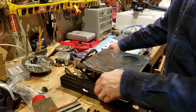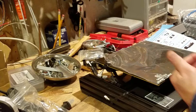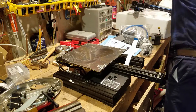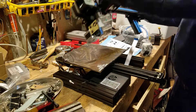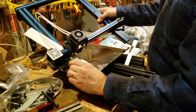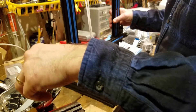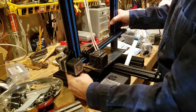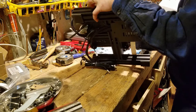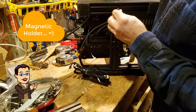If this is your first time building one of these, this is your Y axis and you want to have the front of your machine out here. Now is also the time to attach the Z while you're at it, because this is the easiest it will ever be to reach in there and get that in place. I'm going to pull out the piece of paper, keep my hex keys close so they're easy to grab, make sure I don't pinch any cables, then tilt it on its side so we can get access and put those screws right where they need to be.